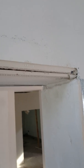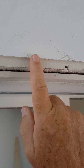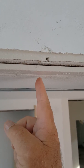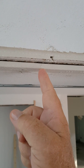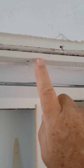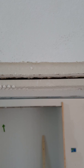If you'll notice, this edge right here is the factory finished edge of that sheetrock, and this edge up here is a cut edge. What happens is the factory edge is tapered so that when the tape bed and texture is done and they tape that joint, they can float it out - it's tapered down and it'll accept the mud and keep everything flat.